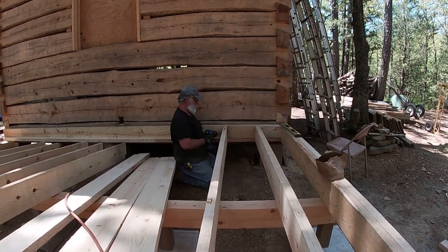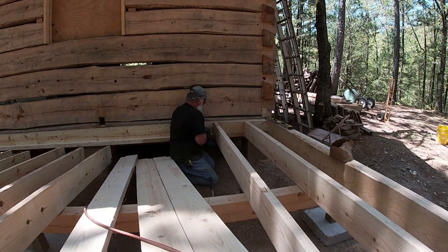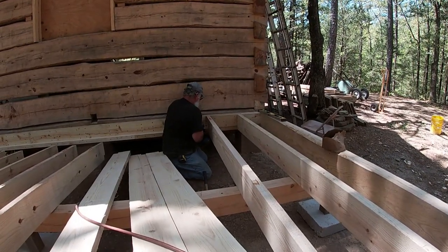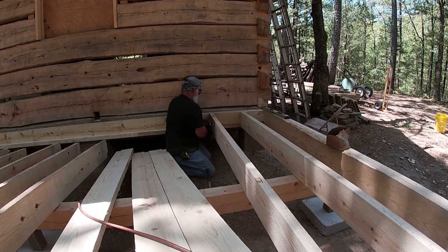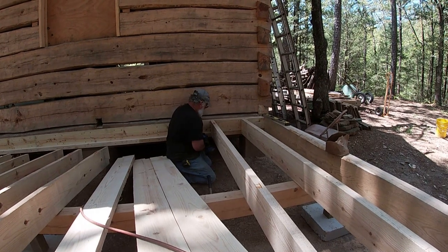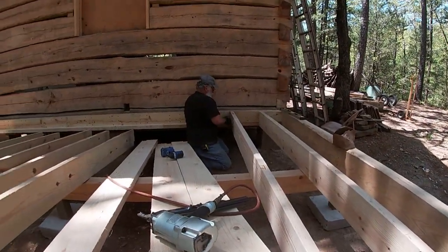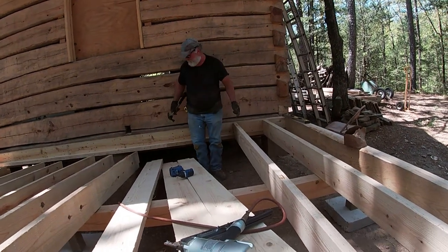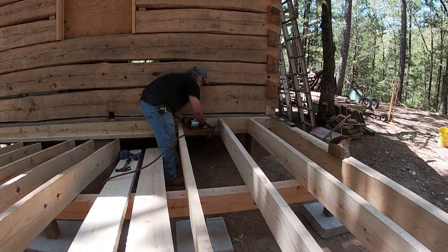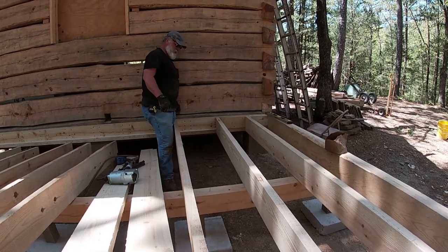All right, we've put the block in between the joist. And on this side, Brother Wayne is running screws into the ribbon, like a toenail. We put one in the ledger. Then he'll take the framing gun and he'll shoot into the ends of that block. Now that's got that caught on that end and it's not going to go anywhere.